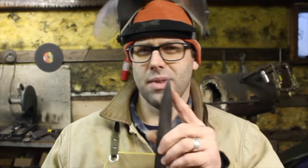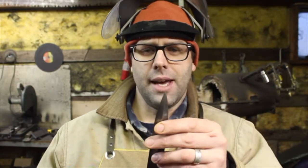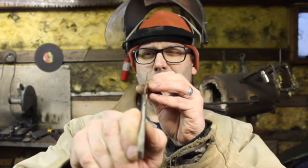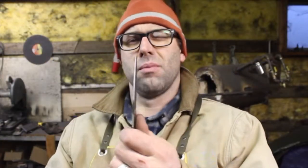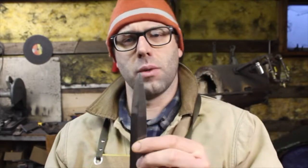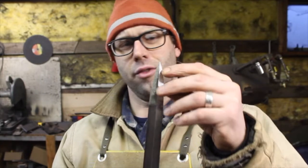Nevertheless, I feel like the tip here is a little bit thin. So I'm going to go ahead and work that a little more, which means I'm going to have to do some more hand sanding. But hey, that's why you test your blades, right? So other than the very tip, it's nice and straight. I've adjusted the tip, the point a little bit. It's a little more robust and still well within the general genre of Fairbairn Sykes.